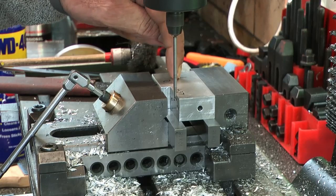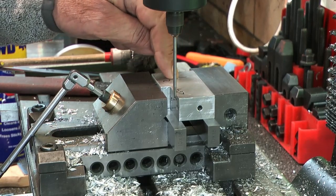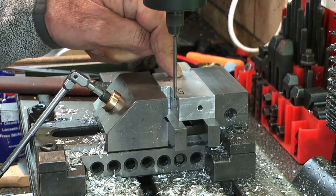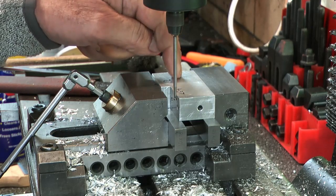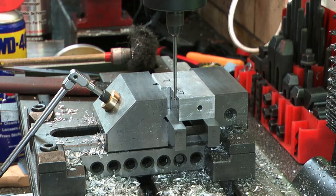So I need to put the center hole in, which is where the cylinder is going to attach to the cylinder head - a reference center hole. I'm on the back base, away from the cylinder, so that's fine. Looking at my drawing, I'm going to put in the four holes that bolt the cylinder to the cylinder head, or the cylinder head support.